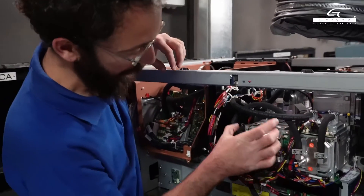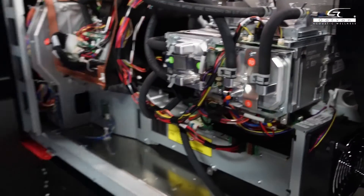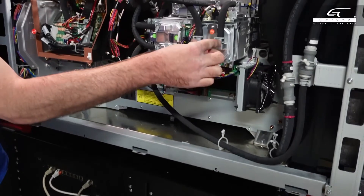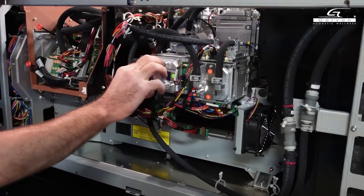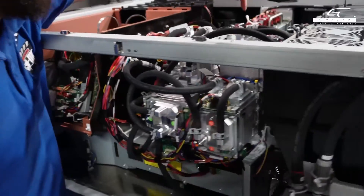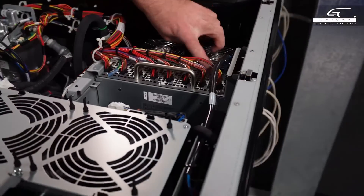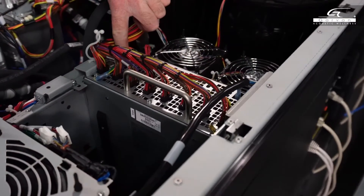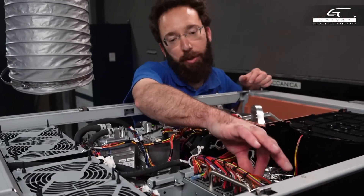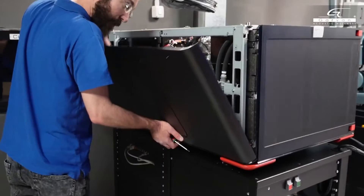Under all these modules you see, there are the various laser modules — red, green, and blue. There are interconnection boards that allow them to communicate with each other. Cooled by liquid, there is a collector above each module through which the water and cooling liquid enter and exit. Inside here are the various control boards for the laser modules. This is a component that can be opened and even have just one board changed. On the slightly larger machines, there is another one like this next to it, because there are more laser modules.